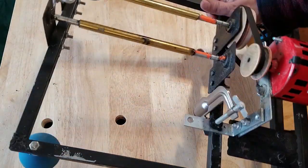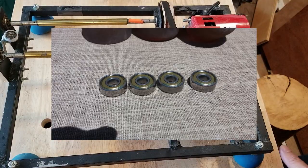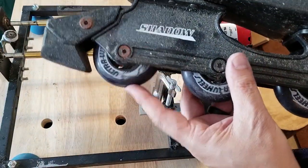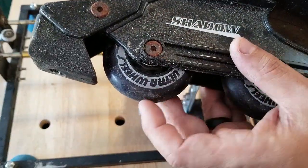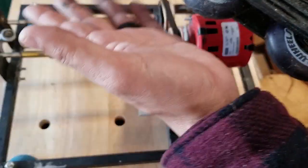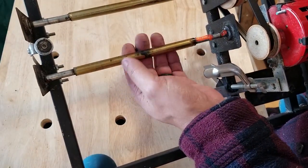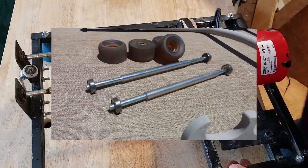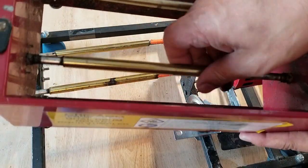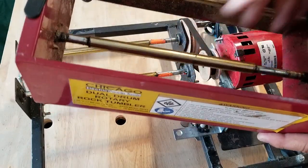For the bearings, I'm no longer using bushings — I'm using bearings. These are regular quarter-inch roller skate bearings. If you go to any junk shop or Goodwill you can pick them up. These were actually made from four-wheel skates — each wheel has two bearings, one on each side. If you buy them new, they're about a dollar each or less, but get a pair of skates and you've got 8 to 16 bearings for free. These steel rods are the same ones that came from a different rock tumbler. These are the only parts I kept, because there's a lot of mystery around the coefficient of friction you want on the rubber slip-overs that go on top of the steel rods to grip the rotating drum. I figured I'd just use these as-is, and they seem to work fine.